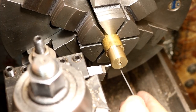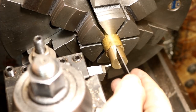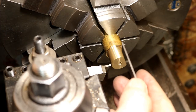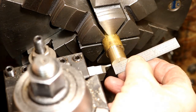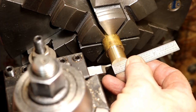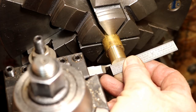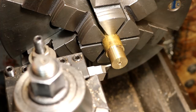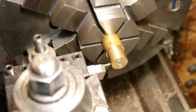Now I've ground up a special little grooving tool — it's just a few thousandths, about four or five thousandths narrower than the groove I need. I'll go in and then I can come each way a couple thousandths and clean it up. I'm just taking my scale and making sure I don't catch on the tool — to flush it with the end just so I don't catch. Now I have to go in 130 thousandths to get to proper depth on the tool, and I'm using my digital way scale to come over 83 thousandths.